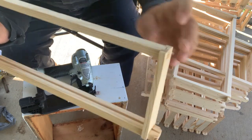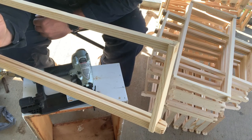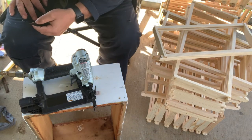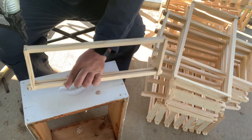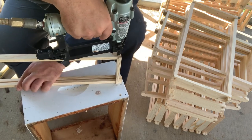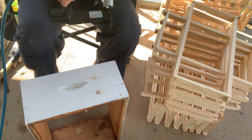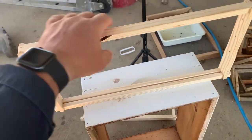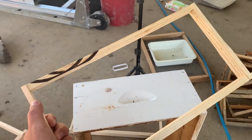That's the only brad that came through. You need to make sure your brad gun is at the right PSI so that you don't shoot it through. I have shot myself in the neck with the brad gun because the pressure was turned up too high — it's not a fun emergency room visit, so don't try it. The only thing that might go wrong is if you get it a little bit crooked, it might come out the side, so watch for that. If it comes out the side it's going to go through your hand — just know that can happen. I don't think it's going to affect the foundation that we slide in there.